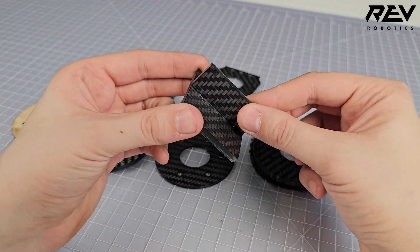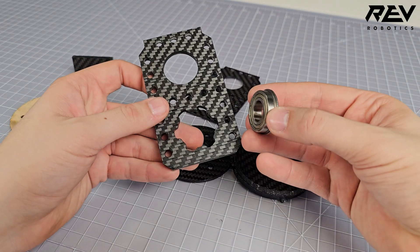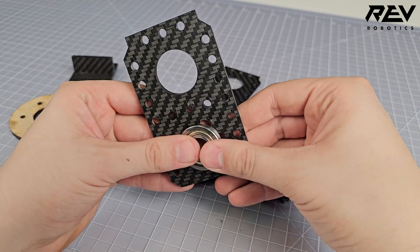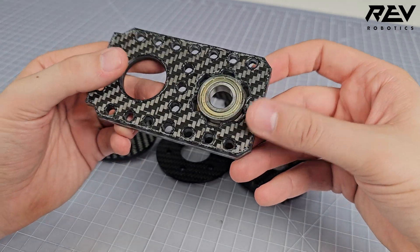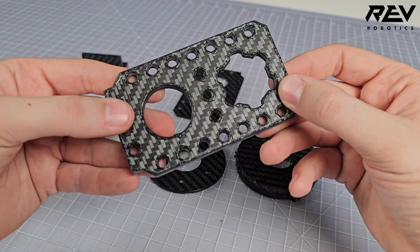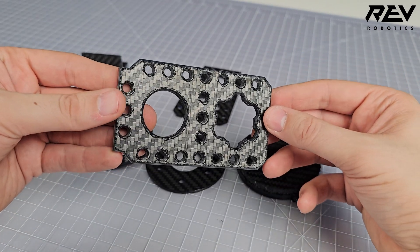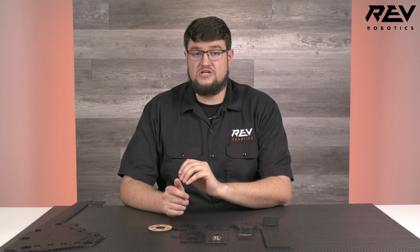Fitment and finish. Before committing to larger parts, test fitment for bearing presses and hardware clearance. For example, on our laser, a 1.1 inch diameter hole results in a snug arbor press fit for a rounded hex bearing, which is 1.125 inches. You may notice some melted plastic on the backside of cut parts, so consider which surfaces need to remain smooth and flat. This excessive material can be sanded down, removed with a deburring tool, or trimmed with a knife. However, ensure the edges remain slightly melted together to prevent delamination.